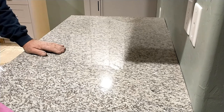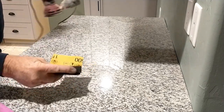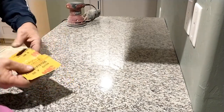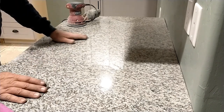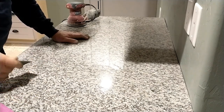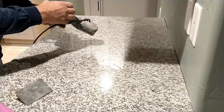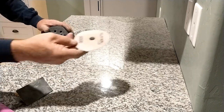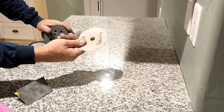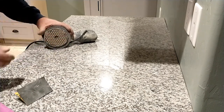After this, as the epoxy finishes out, I just continue sanding with wet dry paper, 1500 and then 2000. On the surface of this, in my situation, it seemed to polish it up and remove any film. And then at the end, I attached one of these. You can buy these on Amazon or from your materialman. It's a 3000 polishing disc, and I just attached that to my orbital sander. It does not work in a high speed grinder.